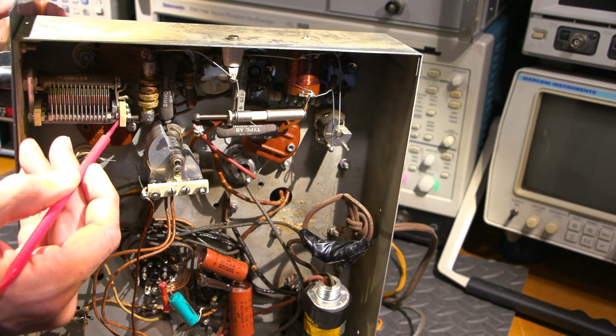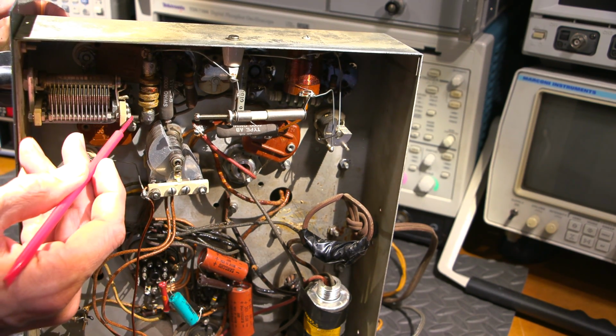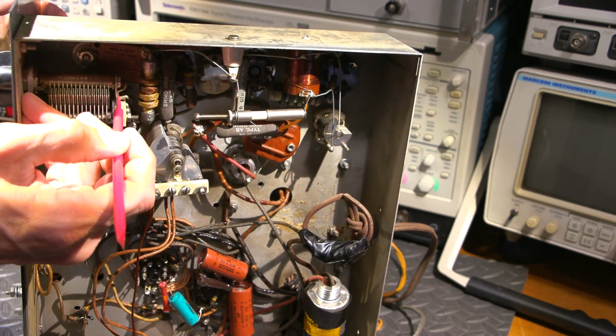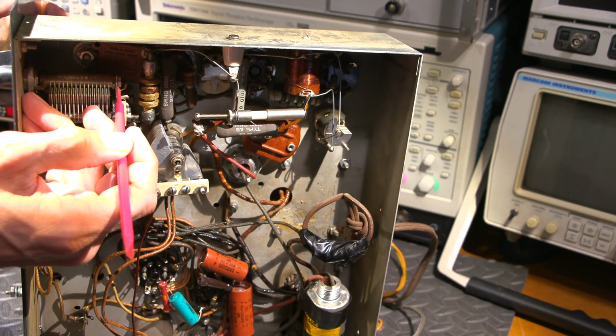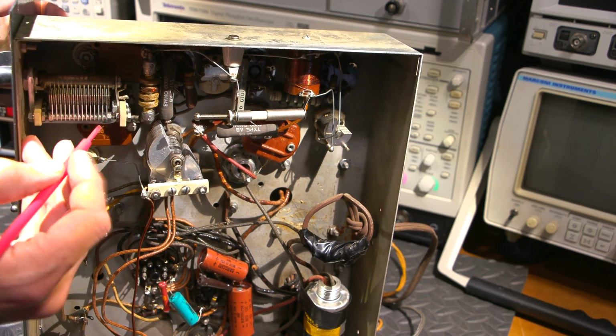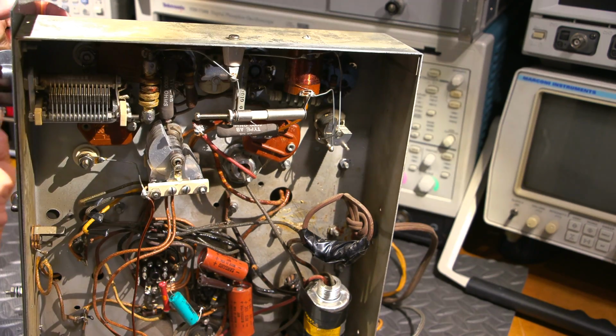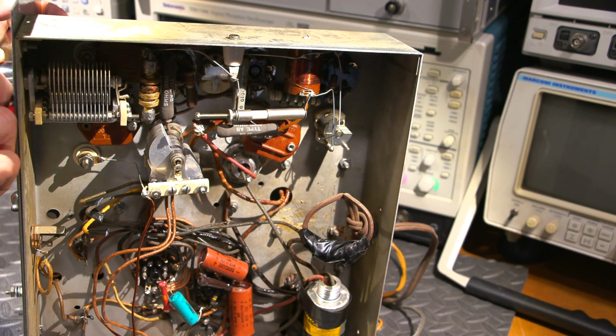If you move these too much and you tighten this up on this side, you'll crack this ceramic wafer that's holding this little strip here that's going to put tension on this. Okay, so you need to keep that in mind. So only usually a quarter of a turn or something like that, maybe a half a turn at max, and that'll cause this thing to get very rigid.